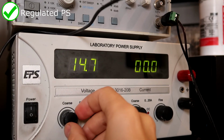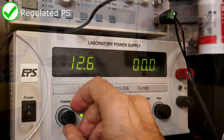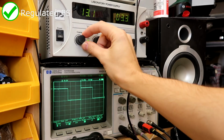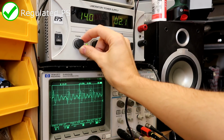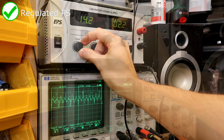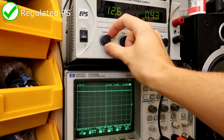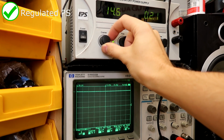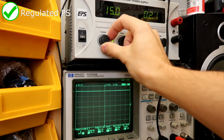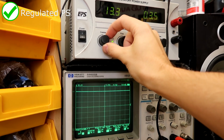You don't need to stress about holding high 14s with this amp, since above 12.6 volts, the rail voltage is regulated to a fixed limit, so you won't really gain any extra power beyond this point. There's a little to be said about less current being required by the power supply section at higher voltages, but the difference between the 12.6 and 14.8, for example, is only about 60 amps. Nothing to worry about with the thickness of these traces and the ratings on these MOSFETs used.